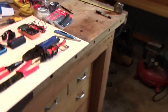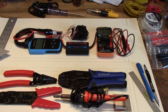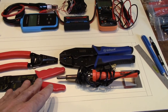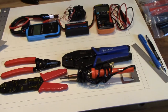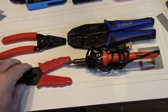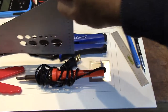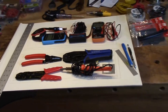I think this would be pretty manageable at 18 inches long, eight inches wide, and maybe nine inches deep now that I'm going to do the lid thing. I'll have the storage in the lid, I'll have the tool tray on top of it - say that takes about three inches - I still have six inches below that where I can put all this miscellaneous stuff. The tool tray also needs some type of divider strip running down it so you've got something to grab and remove it to access the stuff underneath.